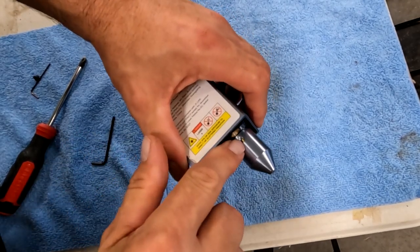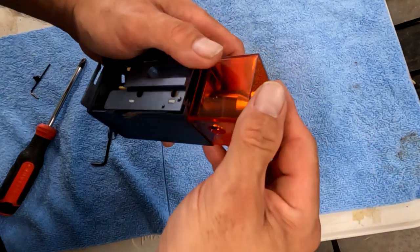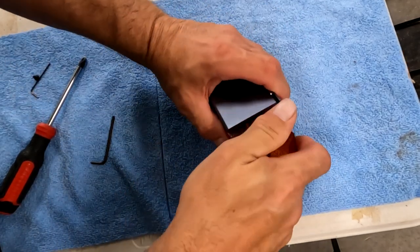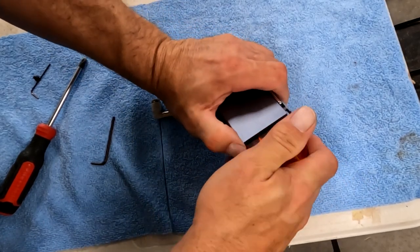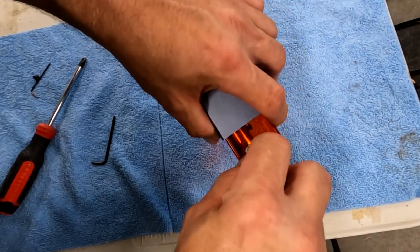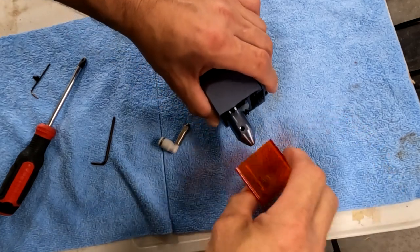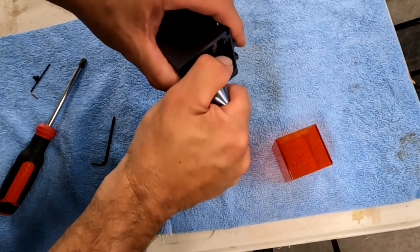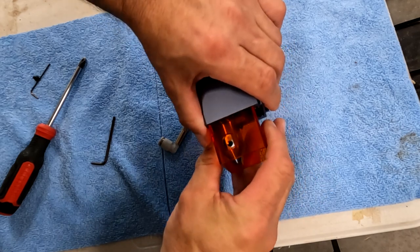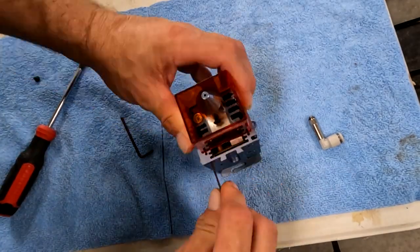Even though it comes with two set screws, you do not want to put the other set screw in because that's going to block your crosshairs. I don't use the crosshairs personally, but if you do, the screw is going to hit them and probably mess them up. So I only need one set screw to keep it from falling off. Line the hole up with the nozzle on the side. I personally didn't tighten the screws right away — take your nozzle, put it through the side, and make sure it lines up straight first. That way, if you have to take the shield back off, you don't have to take the screws back out. Once everything is lined up, tighten everything up, slide your cover back on, and tighten those set screws. Just don't over-tighten them.